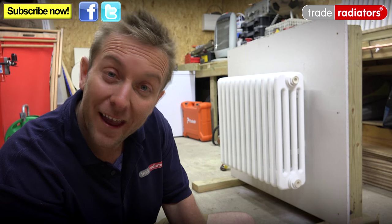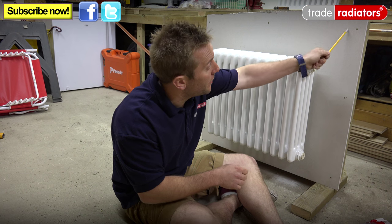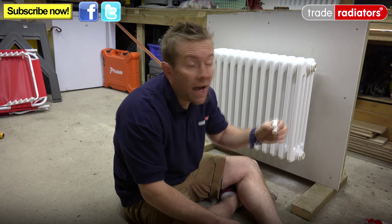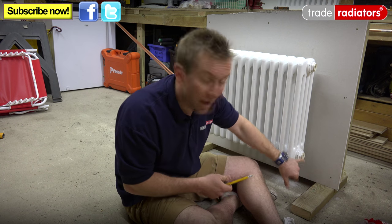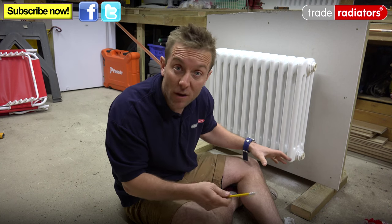So I hope you enjoy this first part of the video and let's go. Firstly let's say that our two drop down legs are coming just up here. Usually what you do is use a double clip like the one I've got here, and that would denote how far away the pipes are going to be from each other. You want to leave yourself enough room to be able to come up into your actual radiator valve. So the first thing we're going to do is mock up those radiator valves going into the radiator.